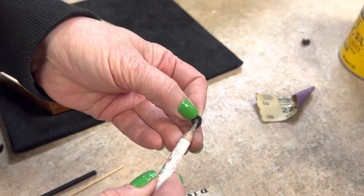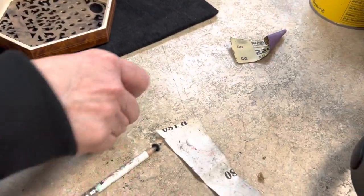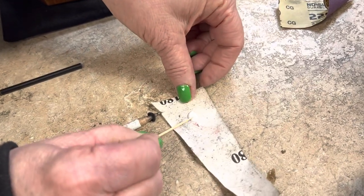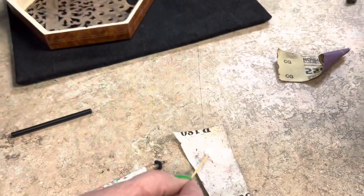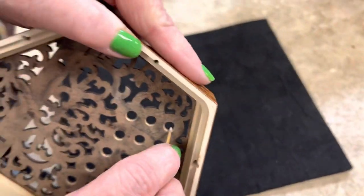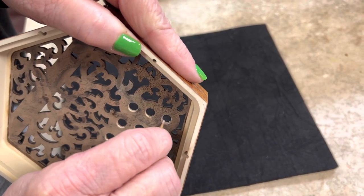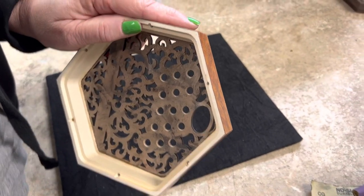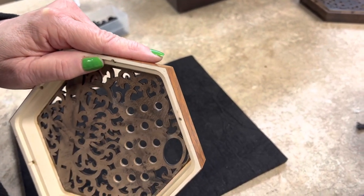Take the pencil and put the bushing on the pencil like so. Then use a white glue such as Elmer's glue, or any typical PVA white glue. Put it on a toothpick and circle the inside of the hole with it, keeping it mostly on the bottom half of the hole, because the bushing is going to get pushed in from the bottom and should drag the glue up to the top.